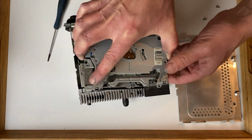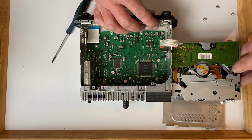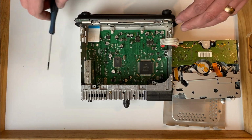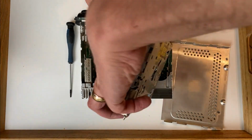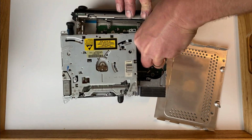You can check the connections in the back of your stereo, paying particular attention to the white, red and yellow iBus wire. In reality, because of the way the stereo block connects, it is unlikely to be this. If you've got issues with your iBus wire elsewhere, then you've probably got bigger problems.